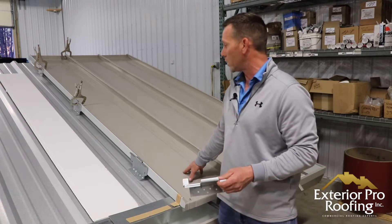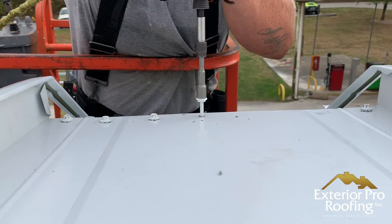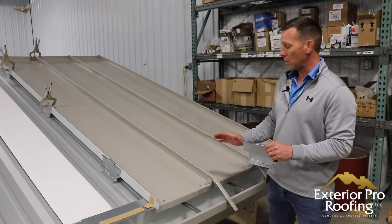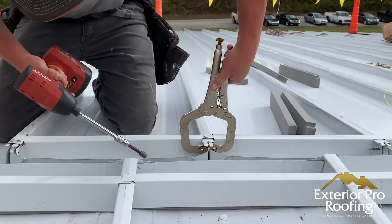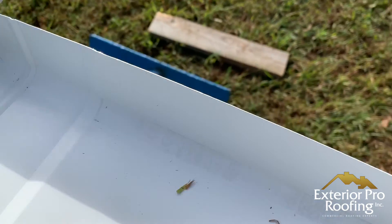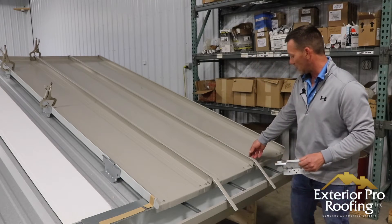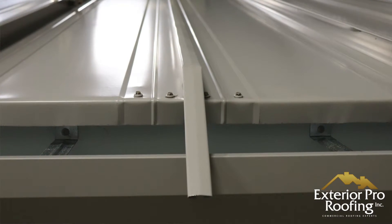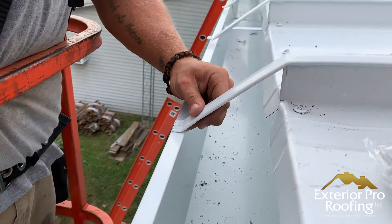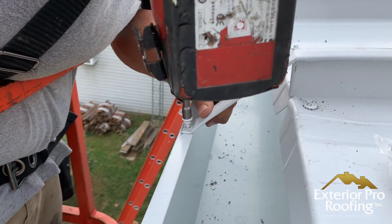The flute fill gives the metal a bit of support so when you're walking and installing, you don't dent or kink the panel. The 238T is special for a variety of reasons — we have several other videos about this metal in more detail. It's a neutral side panel: each side of the metal is the same and it gets a seam cap that grabs the two neutral sides and crimps them together. It's a mechanically seamed panel, so it can go down to a quarter-on-12 slope — keeping very low slope steel buildings watertight. The seam caps get turned down and bent into the gutter strap, providing additional support screwed to the front of the gutter.